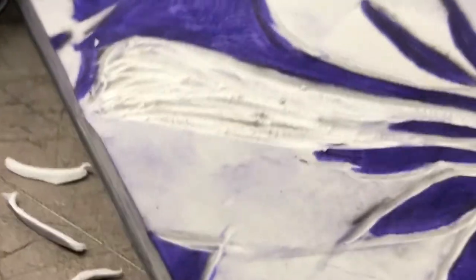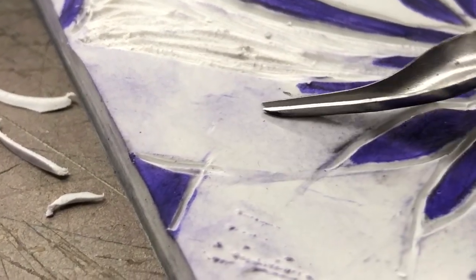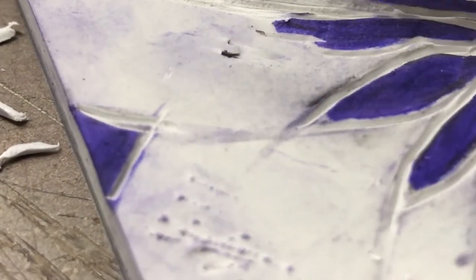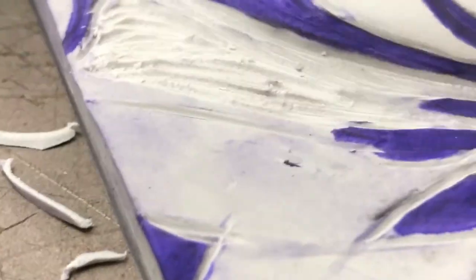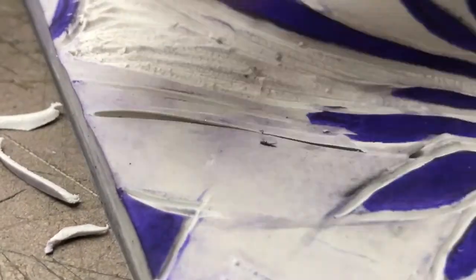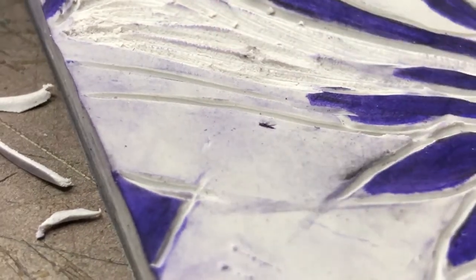As you're cutting along, especially with this little gouge, make sure it doesn't go down underneath the surface. You should be able to see the whole thing sliding across the top — you can see both sides of your gouge at all times. That's how it should be. We're not scooping like ice cream.